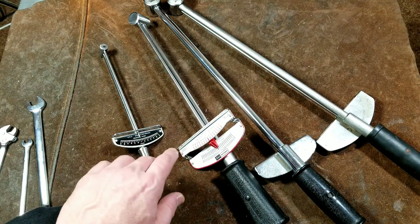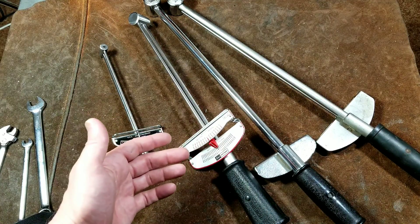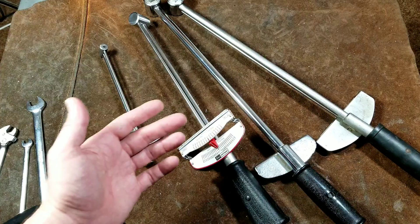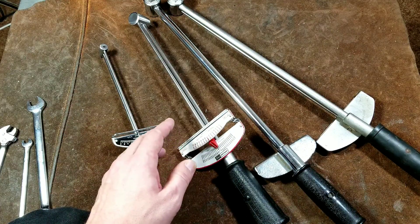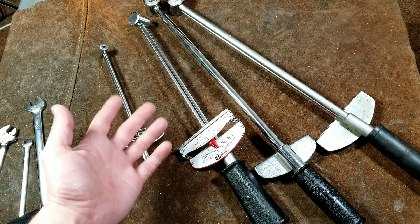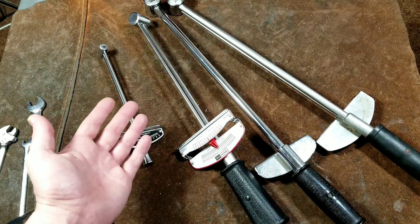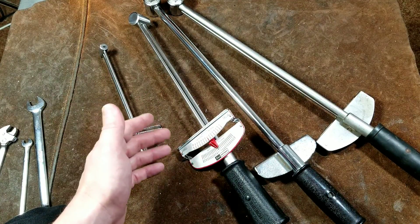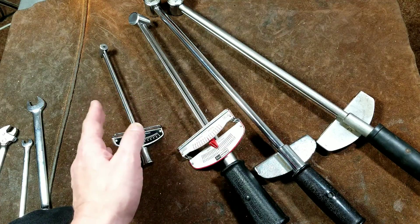Click types are awesome, but if you use one of these against a click type and you're able to look at the scale squarely, you'll find they're actually really easy and quick to use. As you get used to torquing things, you can feel how much force you really need. That really starts becoming apparent with high torque fasteners — I've worked on Subarus with sub-chassis bolts torqued to 180 foot-pounds. I replaced a half axle on a BMW X1, and the front hub nuts on those are torqued to 300 foot-pounds. We used a huge four-foot-long torque wrench and it took two people — it was way more force than you'd expect compared to a lug nut.